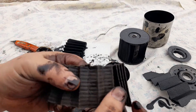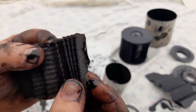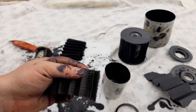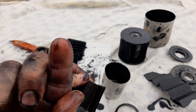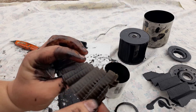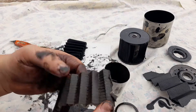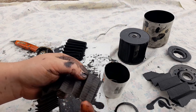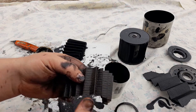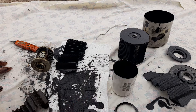Now this paper's got its own story. See how it's brown compared to the black. But also, you can see all these little bits - little bits of carbon trapped in the valley of each pleat. So this engine makes a lot of carbon and it comes off as hard bits. You can see all the little pieces on my finger. On the back side it's pretty well clean - there are no shiny metal particulates. It's just carbon bits, but the filter is brown, which is what I'd expect. There's no sooty black oil, but there are hard carbon particles in a basically brown oil-soaked filter. That's probably what you'd be looking at for a basic town car oil filter.